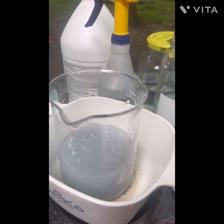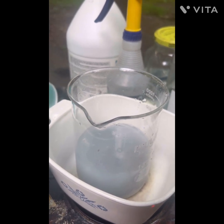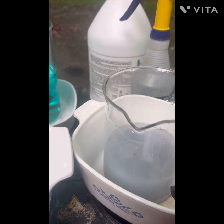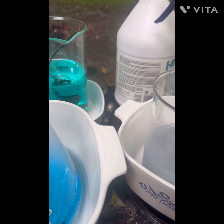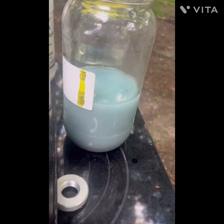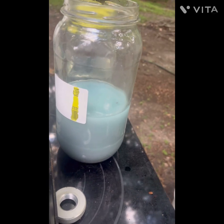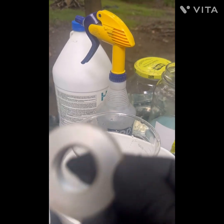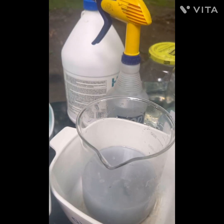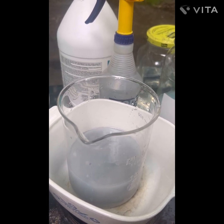And you can see here that I am heating up the chlorides to put any lead in solution because it's water soluble, and then pour it into my bucket over here for my silver chloride bucket. It's really a container, my pickle jar. And then, like I said, we're going to use the hydrochloric acid and some aluminum to go after that silver. So that's it for the silver plating, and we'll come back.